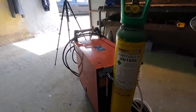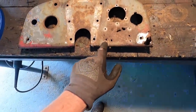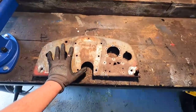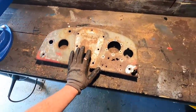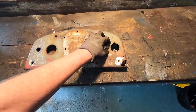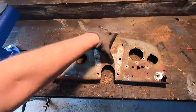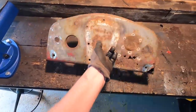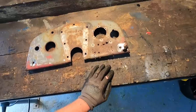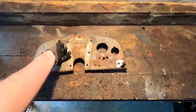I need to put a plug on it. This is our dash — you can see where it's badly corroded around here. We also got a replacement dash from Conaty Tractors, but when I had a proper look, my own is actually in better condition. There are pieces on the other one I can use, like a piece on the other side I can transfer across. The top isn't too bad either. Hopefully now that I can MIG weld, I'll be able to cut this out, make a little template, put in a new piece from the old mudguard, and weld that in to leave the dash perfect — in theory.